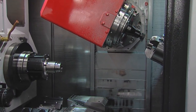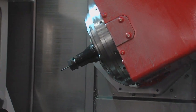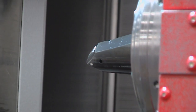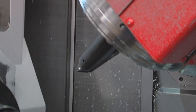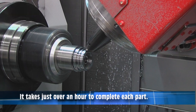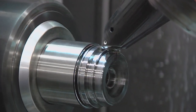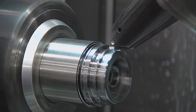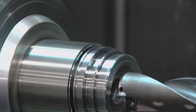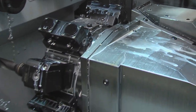With this particular process, we can use one tap and make a hundred parts. Now the upper head is going to rotate around and go get a turning tool — there's the roughing tool that roughs out the profile of the part. It'll come down and face off any extra material, then rough turn everything plus five, all the features it can reach. The lower turret goes in and roughs that out too — that's insert drilling to remove a bunch of material, and it's a lot faster than milling it out.